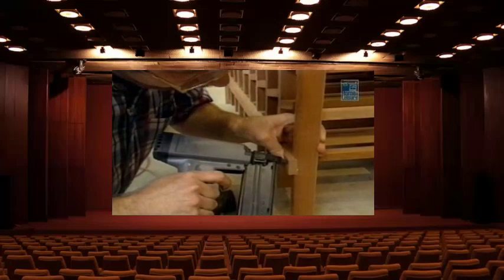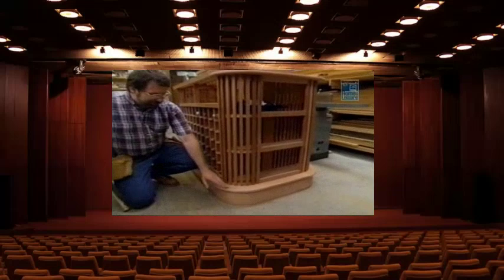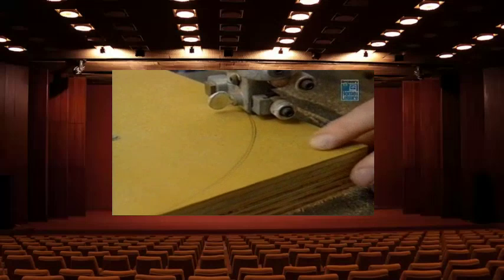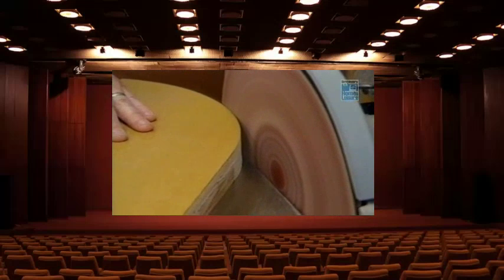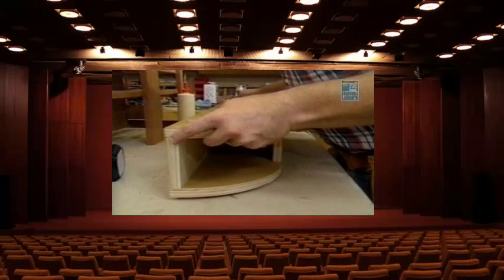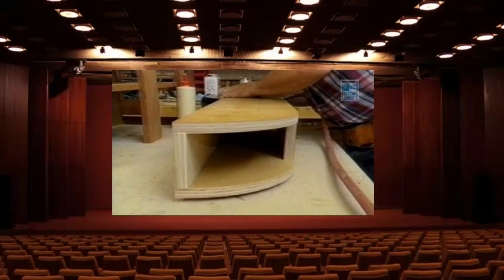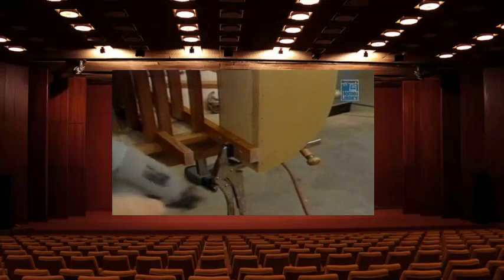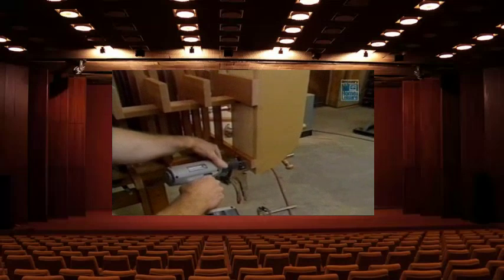Now let's stand it up and put the cleats on the other side. Now we're ready to start working on the base. Underneath all this redwood is a heart of plywood around which I can bend the final pieces. I take two pieces of three-quarter inch plywood, attach them together with screws, and cut both at the same time so they'll be identical curves. I then put a spacer in between — assembled with glue and nails — and clamp the plywood form to the standards, attaching it with screws through pre-drilled holes so that the base will be removable.